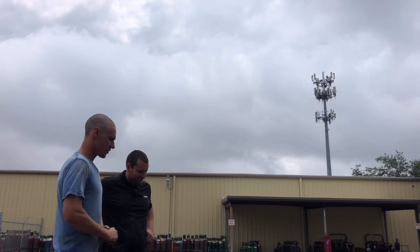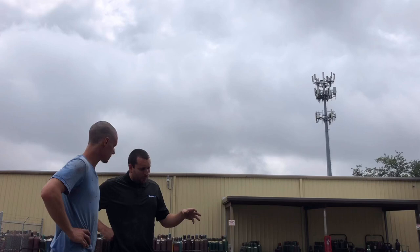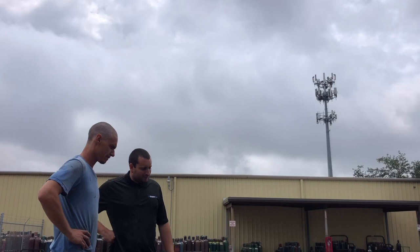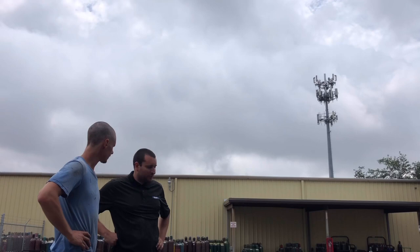So this Pipe Pro is basically like a hybrid machine. It's mainly a generator that has another welder that sits inside of it. What they do is they put an XMT 304 in it, because it's a Pipe Pro 304. It's an inverter-based machine that's run off the generator. The problem with this one is the control board for that inverter welder is bad. So you'd have to replace it. I don't know if it's even still made, but at the time, it was somewhere around $1,500 for that board. I might be interested in this machine, because I've always wanted a diesel machine.